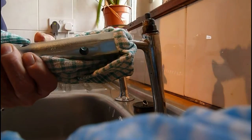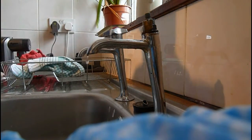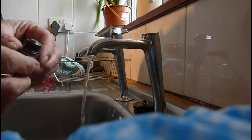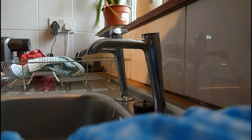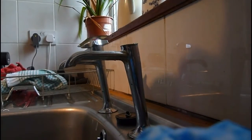There she goes — we've got the body of the tap off. Take the spanner away and it comes out. Now here we have the assembly. We'll renew the washer in a moment, but the main thing I want to show you first is the seating of the tap, which is down inside there.